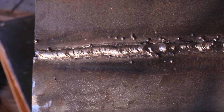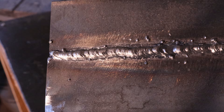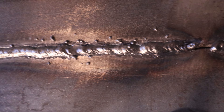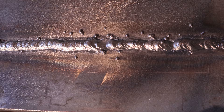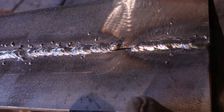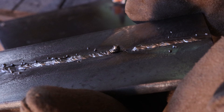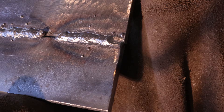6013 was kind of a difficult weld because this isn't a really hot rod — it doesn't want to melt too far away from where the arc is, but it still is fairly easy to control moving forward. I did have some hiccups right in the middle where the arc would stop, but it was pretty easy to get it started again. The stop at the end of this long weld it did not want to start that arc again. I could have gotten it started again if I took a grinder to that nub, ground that down, and started the arc again, but instead I just finished the weld like that.